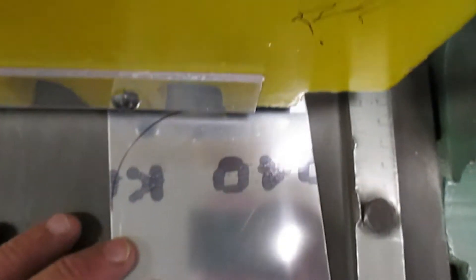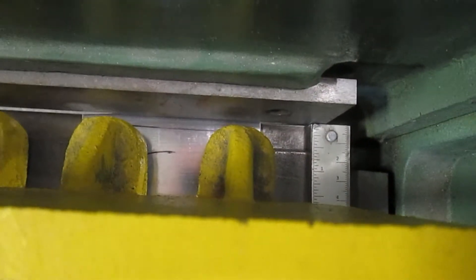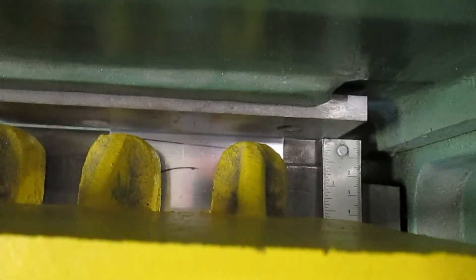When you look at your piece of metal you can just faintly see the edge of that black line — super nice and accurate. Always better to cut showing a little more of the line, because you'd rather be able to file down to exactly what you want rather than cutting too much and having to throw the piece away.